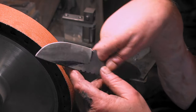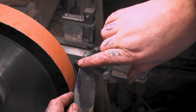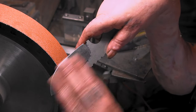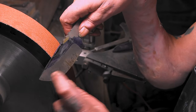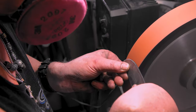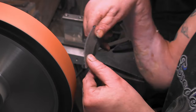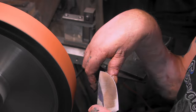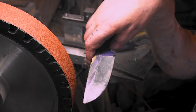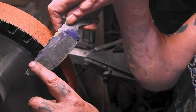It went a little crazy on this side — not too bad. We can bring it up after heat treat, but we don't want to come up anymore here. I'll just hit it with the 120, but we're going to have to bring this side up just a little bit. When we surface grind it after heat treat, this won't come down. So I'm not going to bring this up too much. Make it look like I meant to do that! We're close — this will come down with surface grinding, and that's where we want it.